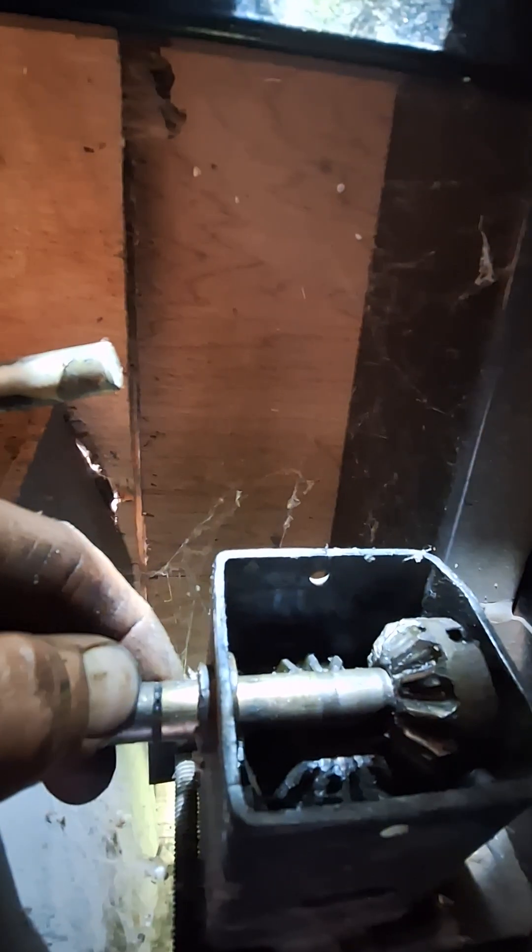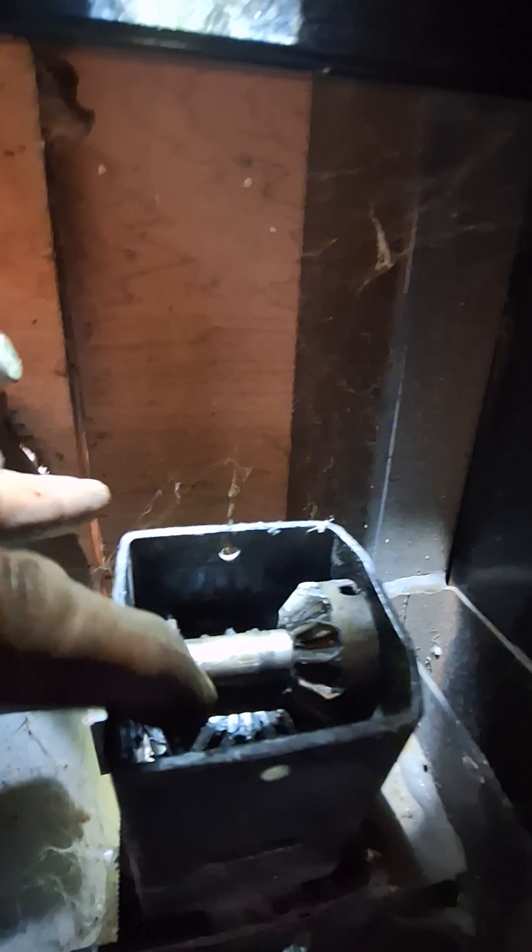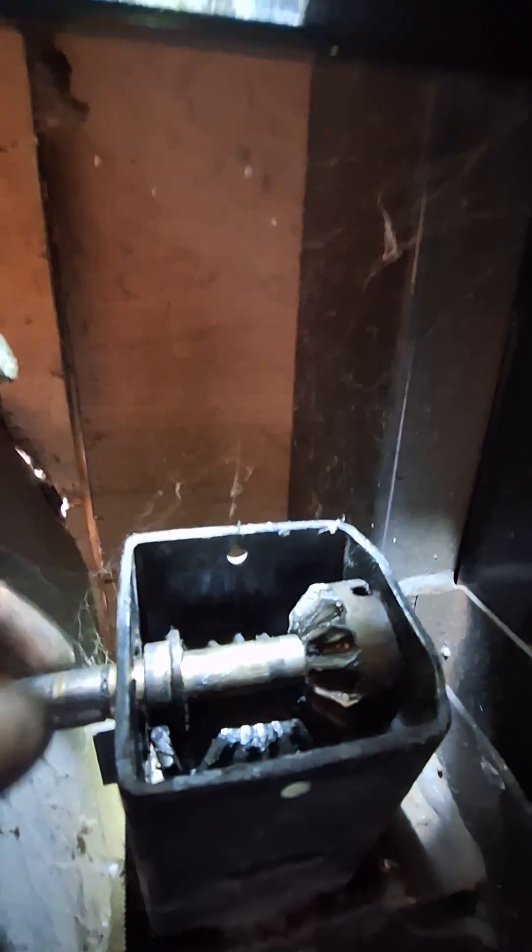Mine, I was lucky — it wasn't in that situation, but it wouldn't slide out until I ran a file on it. Then the spring clip — if you hammer it back that way a little bit, you can distort it and get it off a little bit easier, then replace it with a clean one, because it can be stubborn sometimes. In all cases, at this point, it'll slide out either way.